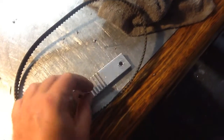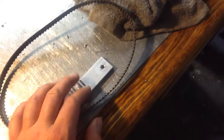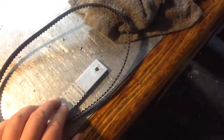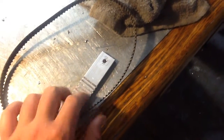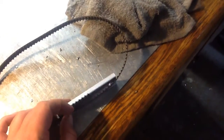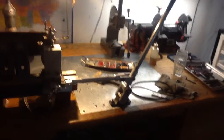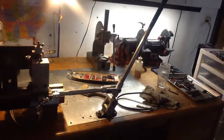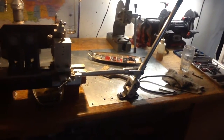So I had built this shaping system for the lathe and realized I could use it to make these clamps. I've got the ridges shaped to interface with the belt teeth and then another piece will go over there to clamp it down. There's still some waste stock on here — I'm just going to cut this part and this part off so we'll have a nice little short clamp, drill some holes to bolt it down, and get this belt bolted onto our armature. So let's take a look at the lever. I originally built the shaping lever for the lathe to build gears and such, but I realized there's a bunch of other stuff that can be done with it, such as shaping that part we were just looking at.